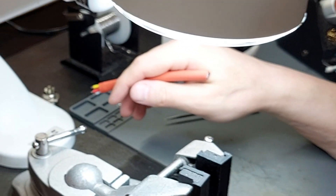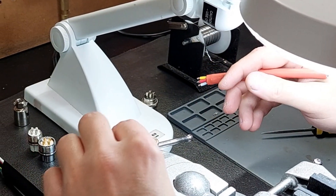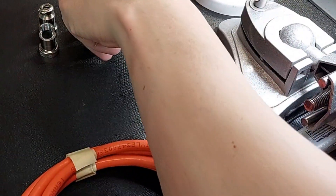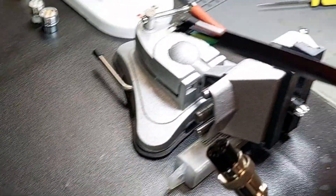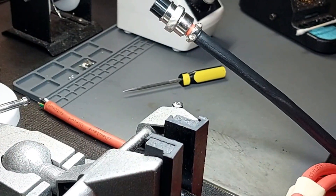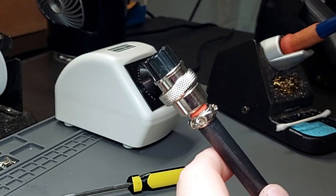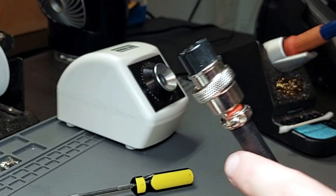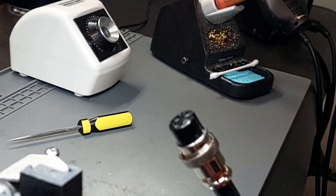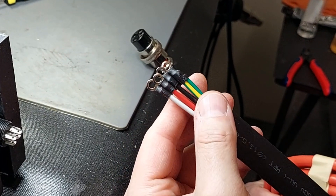This is a good video because it shows you a lot of what guys ask questions about. I get more questions on spindle cables than anything else. Here's a client cable that's done using the black connector. You can see exactly what we have — this is 10-foot. You can see we have our stress relief here, the properly machined casing on the connector. Inside here we have Loctite placed so that the screws do not vibrate loose. On the opposite end, these have all been polished and protected with Deoxit Gold.